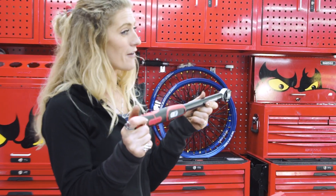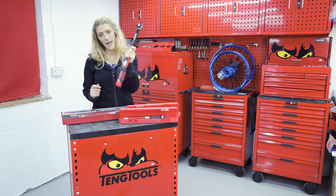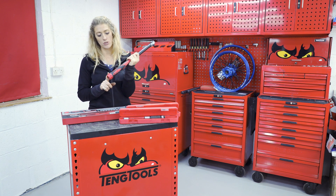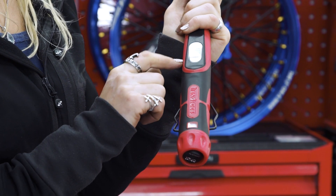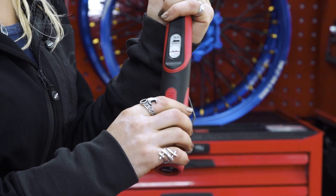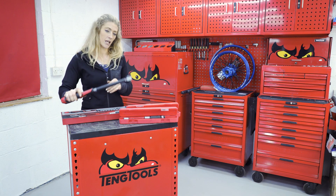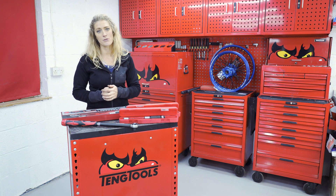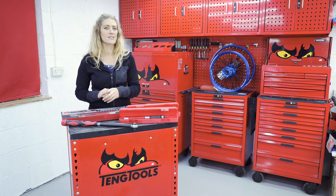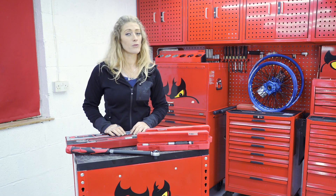There you have a warmed-up torque wrench. Next, every time you use your torque wrench make sure that you leave it with no torque applied — put it back down to zero torque. That prolongs the life of the internals. When putting it away, make sure it is in a dry place without any extremes in temperature, in an environment that isn't conducive to corrosion, and that will prolong its life.